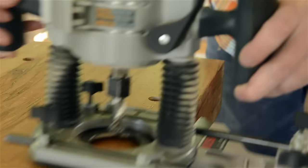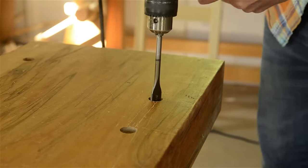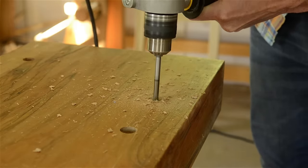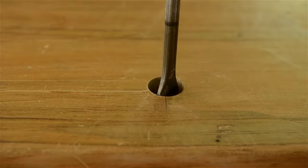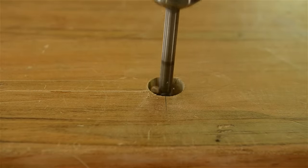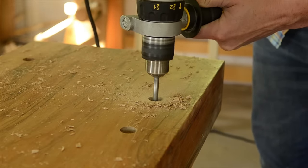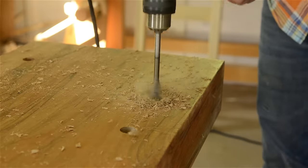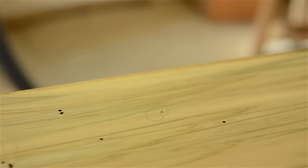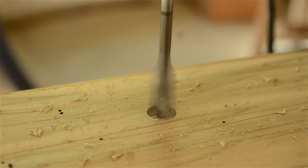Then I finish boring the hole with a spade bit. I prefer to use a powerful corded drill so I don't burn up the motor on my battery powered drill, especially on thicker workbench tops. You can certainly do this with a brace and bit, but just be prepared for it to take a lot longer and possibly have holes that aren't quite as tight due to movement while boring. I watch carefully for the tip of the spade bit — or the lead screw in the case of an auger bit — to come through the bottom of the workbench. Having a friend or child watch for you is an even better idea. As soon as the tip starts coming through, I stop boring immediately. Then after getting all the bench dog holes to this point, I flip the workbench top over and start boring back through the little hole. This prevents ugly blowout and gives a nice clean bench dog hole.